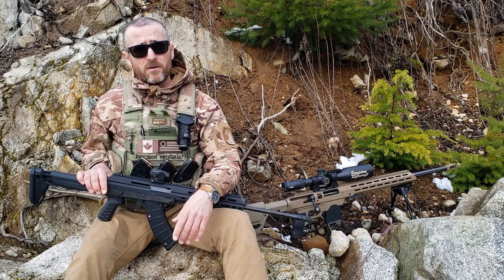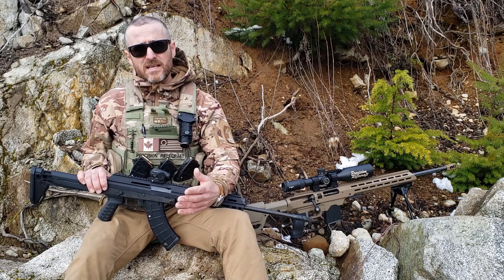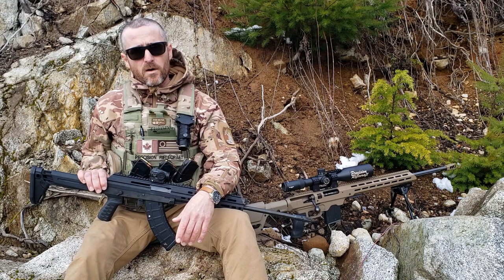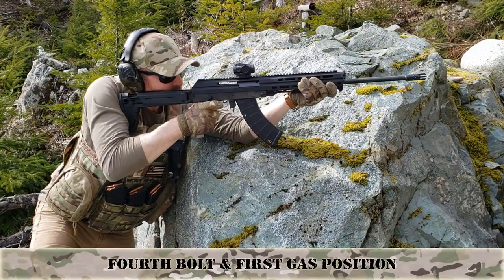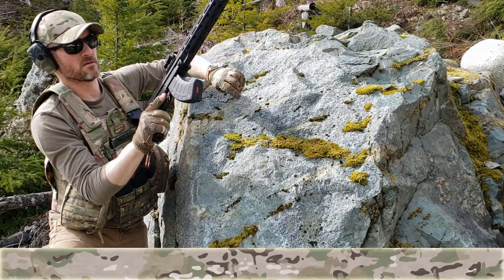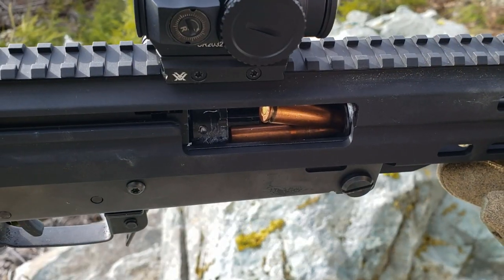This was the fourth bolt for this rifle. After about six months in total, we got the new fourth bolt and took it out to the field. I returned the rifle to the first gas position — the standard position for normal operating conditions — and went to work. It failed after just two rounds with a stovepipe. After I cleared the stovepipe and tried to run the bolt, I got a double feed.